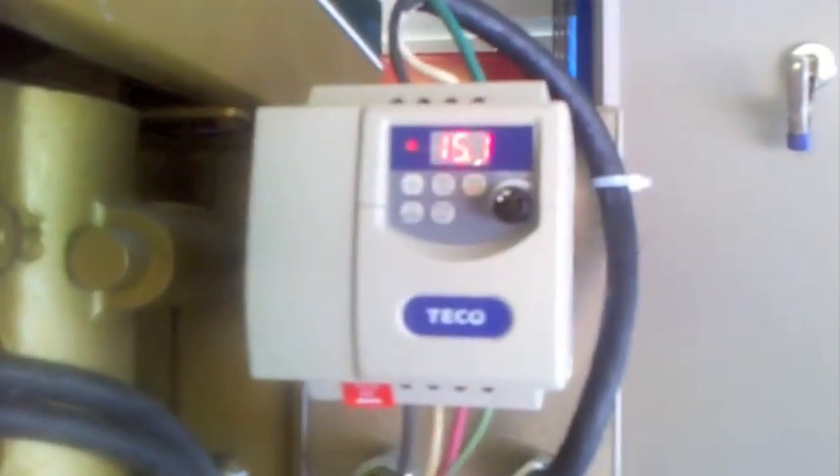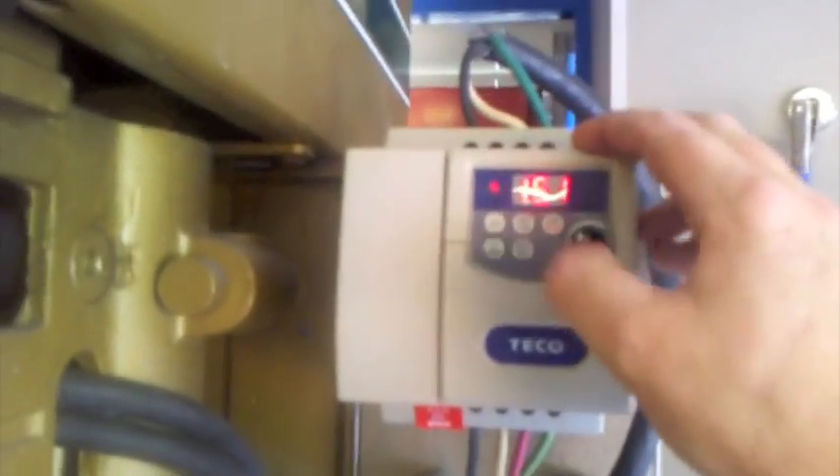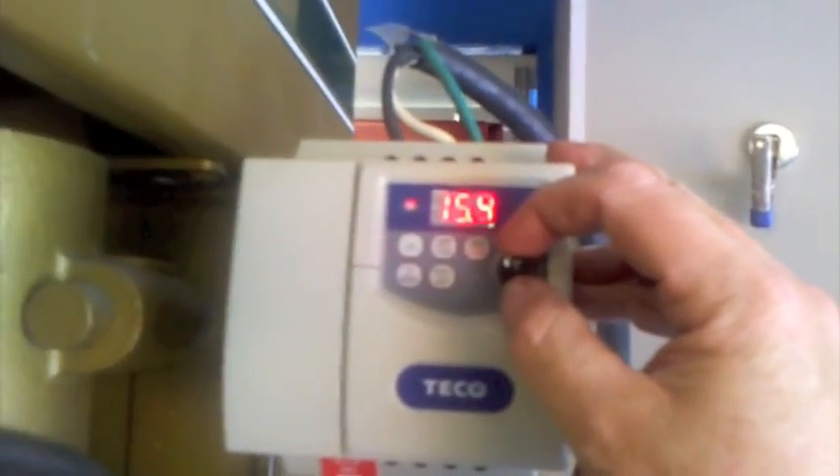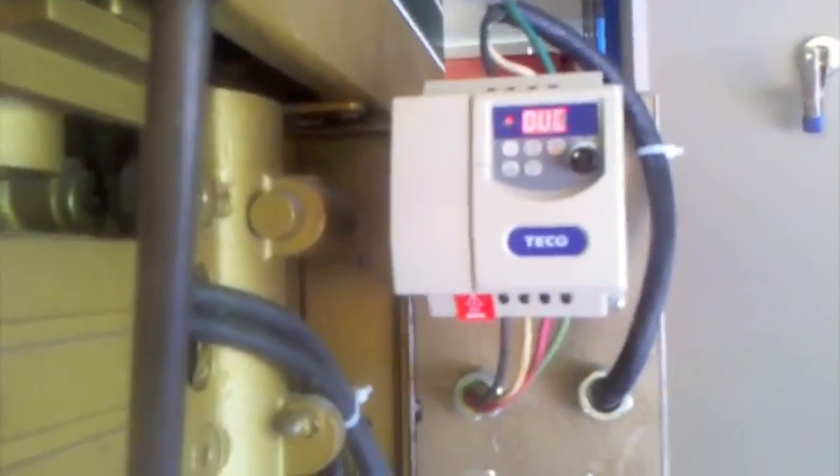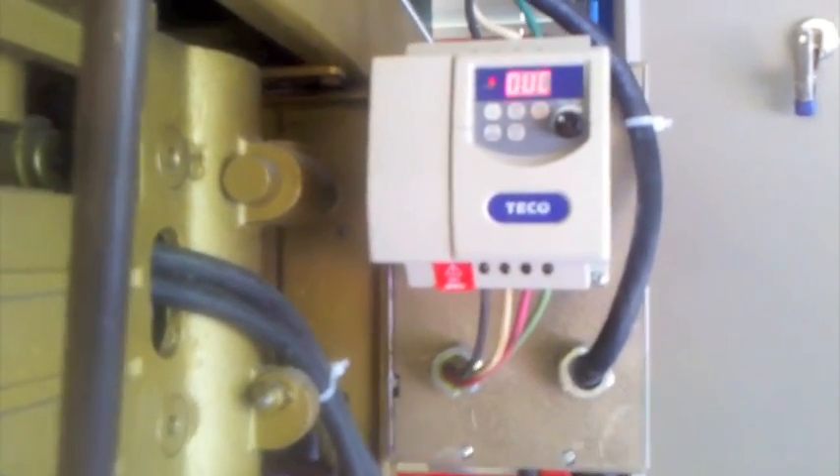Let me go ahead and operate it to show you how it works. I'll hit the start button — you see it shows 220, and then an initial starting value of around 15 hertz. I'll click run, and you can see it ramps up. Look down here and you'll see the quill beginning to move at pretty low speed. As I turn this dial, I can ramp up the speed and you can hear the motor increase. It's running at 60 hertz, which is about full speed. I hit the run-stop button and it shuts back off. I think that error message means it's lost power — I'm still working on programming this thing. Whoever writes these manuals, it's a nightmare, but I'm slowly getting it operational.